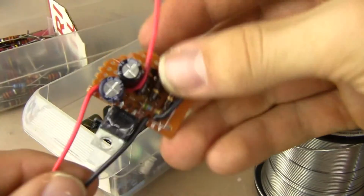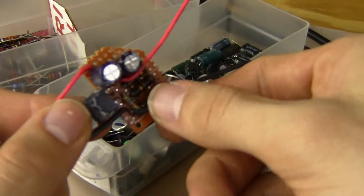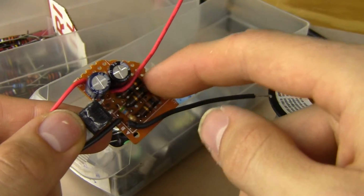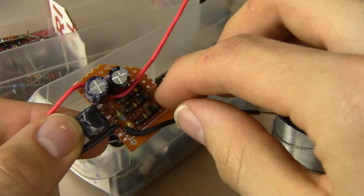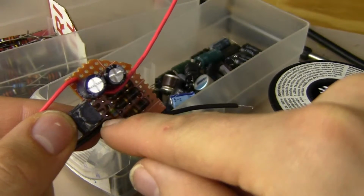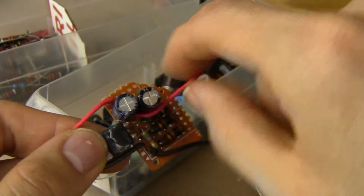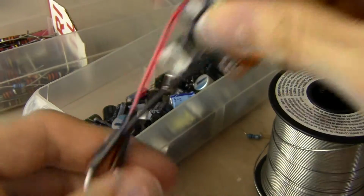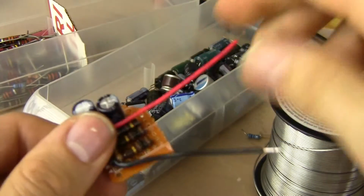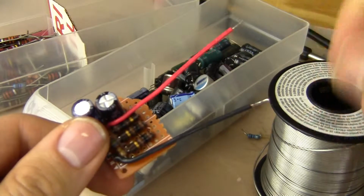Okay, I'm done soldering the circuit now. There's the LM317 right there. I'm using a 150 ohm equivalent resistance using 3 100 ohm resistors, one in series and 2 in parallel, and all that in series. So it's 150, and then I'm using a 560 ohm resistor for R2, and the 150 for R1, and just output filtering caps, nice big ones, just for extending the line around, and also have it connected to a 9-volt wall wart adapter. And then these 2 wires will just go out to the battery terminals to power it.